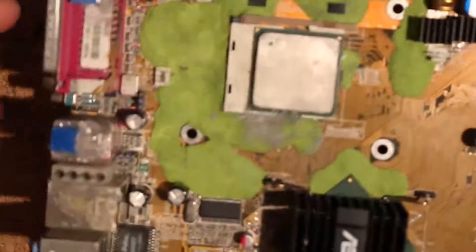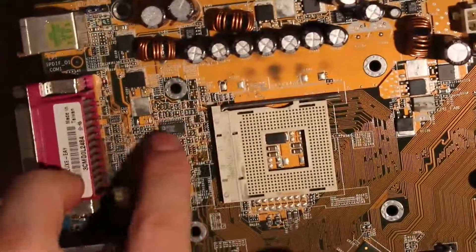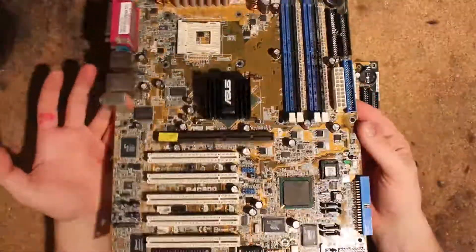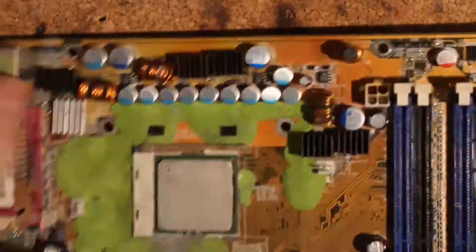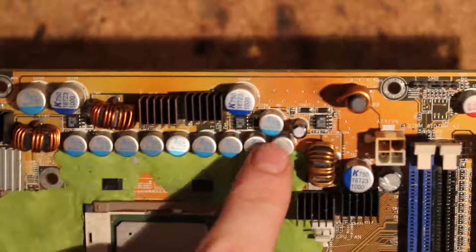Unfortunately I can't show you the vcore mod on this board because we have insulation on here, but I have another one — this is your vcore VRM controller. This is a non-dash-E Deluxe, a board I never even overclocked, just stock. It posts but that's about it, just one of my spares. These heat marks are from the previous owner, who also managed to burn the four-pin connector somehow — I think the cable didn't fit perfectly and caused a huge voltage drop.